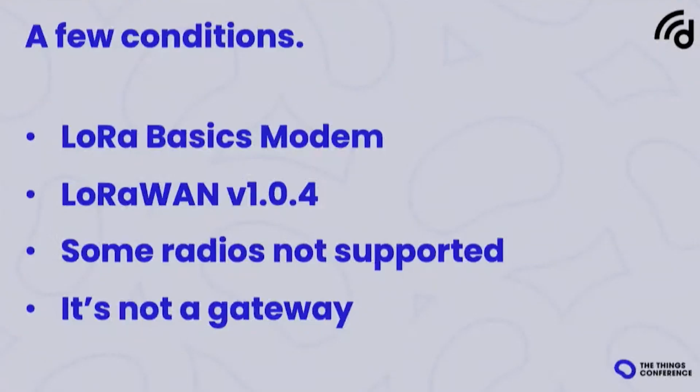The relay is not a gateway. A lot of people think, well, I can just use this and I can connect it directly in. I don't have to put in a gateway and use the expensive connection. I don't have to have cellular backhaul or find a way to power it. That's not true. The relay is intentionally trying to extend range to the sensors that you're having trouble with, or get it to something that's downhole that needs to go out in a new direction. This is not a replacement. Now, if you've been using gateways as a kind of a pseudo relay, this is an excellent change and a nice upgrade.